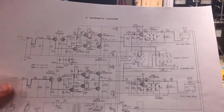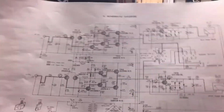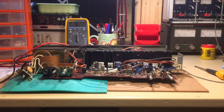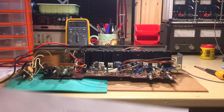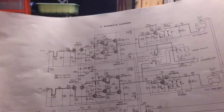Alright, so I suspected resistors, diodes, active components like transistors, but they are totally fine. Man, what's going on? I measured resistors, and they are all within spec. But then I realized, well, look at those capacitors. Those capacitors have 41 years on their back. So I suspected capacitors, perhaps coupling capacitors. I still don't know what the problem is, but I'm going to troubleshoot the thing with you.